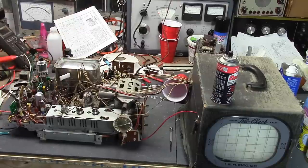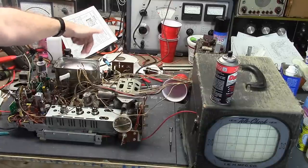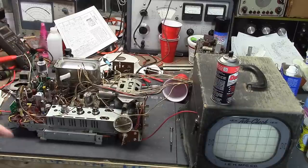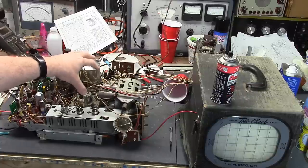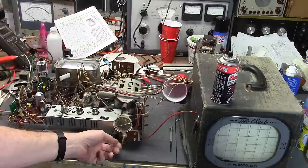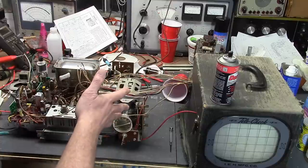While working on it, I noticed a few things. The AC interlock is broken — it's broken in half on a little phenolic board. I don't need to replace it to plug the set in, but it really needs to get replaced. There seemed to be some charring or discoloration in this area — some residue on the metal. Nothing obvious that had gone up in smoke, but some work has been done on this. The power switch has been replaced — it's now a push-off/pull-on instead of push-on/push-off. I think the rest of the controls are original.